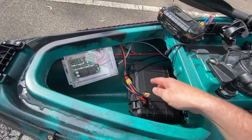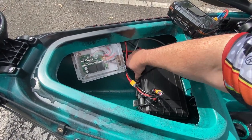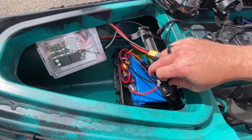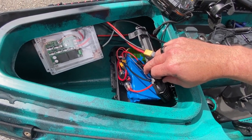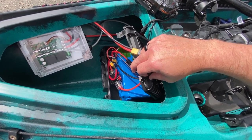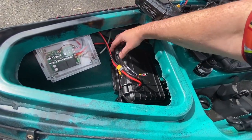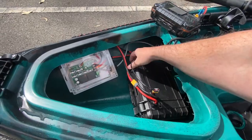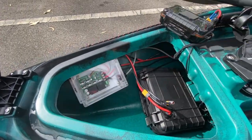The other battery is a handmade 50 amp hour lithium ion battery made with NCR 18650B Panasonic cells — about 3,400 milliamp hours each. They're in a 4S 15P configuration: 15 batteries in each parallel group, in series four times, giving around 50 amp hours. I was on this battery today, probably for a couple of hours, never at full throttle, and I'd bet I'm still at at least 50% charge.